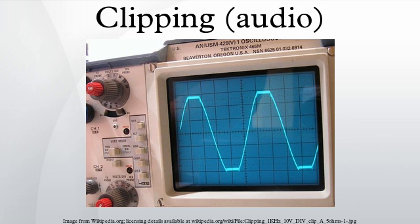at the cost of audio fidelity. Effects of clipping. In power amplifiers, the signal from an amplifier operating in clipping has two characteristics that could damage a connected loudspeaker. Because the clipped waveform has more area underneath it than the smaller maximum unclipped waveform, the amplifier produces more output power. This extra power can cause damage to loudspeaker components, including the woofer, tweeter, or crossover, via overheating.